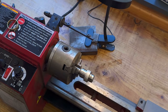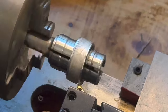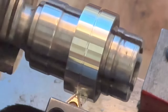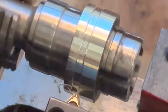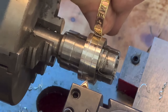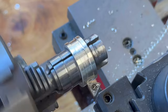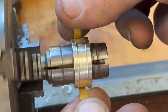Once that's finished, we're going to take our Morgan dollar, get it chucked up on the lathe, get rid of all the detail on the outside, and then cut our channel. I know a lot of people in previous videos always ask why I remove all the detail of the coin. But in reality, there's so little of the coin's detail left — it doesn't look right, it looks confusing. And when we go to shrink this thing down to get the spinner portion on there, it would have obliterated any detail that would have been there anyway. So it doesn't really make sense to leave the detail on a spinner ring.